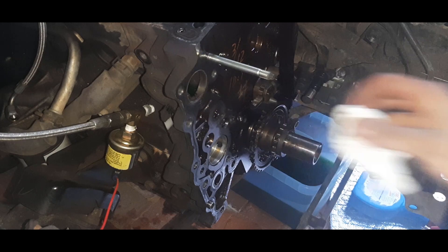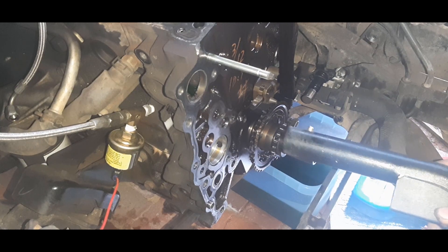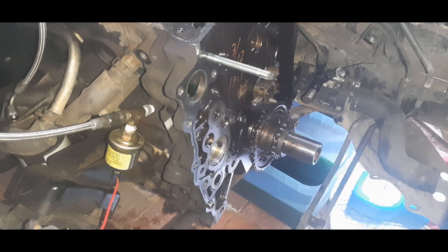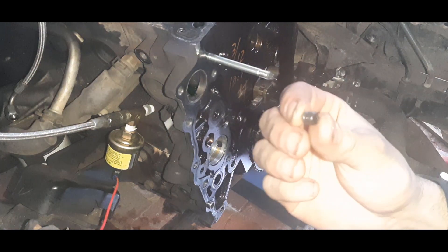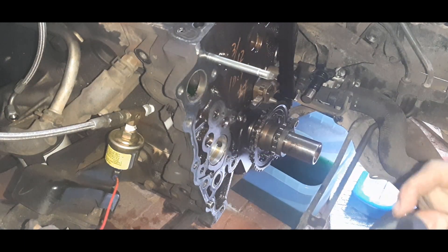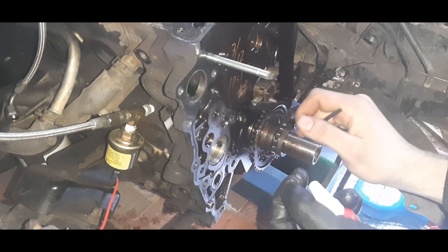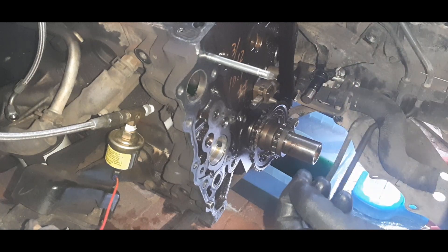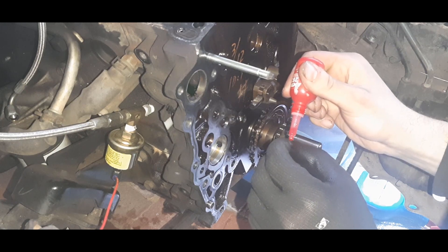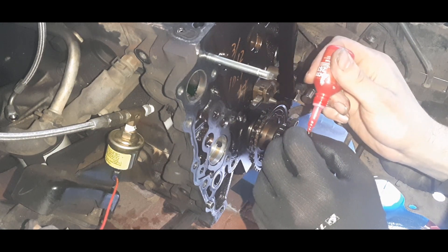Give it a nice clean-up. I've got a vacuum cleaner here — turn it on and suck out the rest of the chips. Then grab your grub screw and put red Loctite on it, and do it up held tight into the block. Don't do it too tight because you could strip out the threads and have to go up another size.